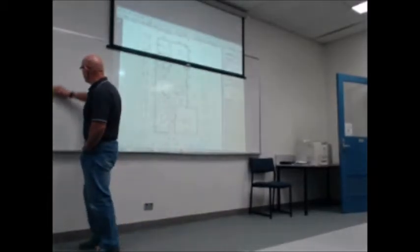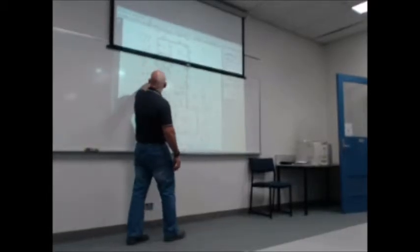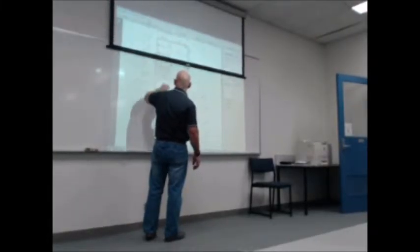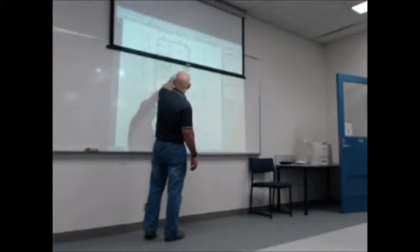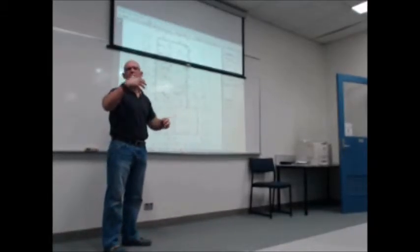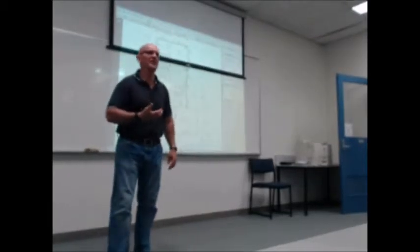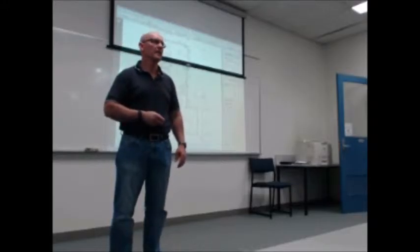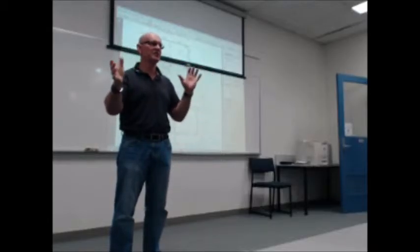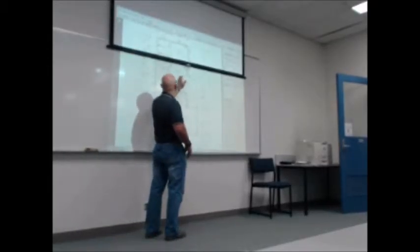Let's do a little exercise. Everybody work out the area of each floor: bathroom, toilet, laundry floor, and work out the kitchen. Everything with tiles, do them separately. Walls we'll do later, now we'll just do the floors. I just want to see what numbers you come out with. And put your margin of waste on as well. You're going to get two figures, one for the wet areas, one for the other.